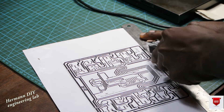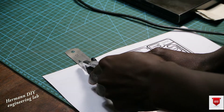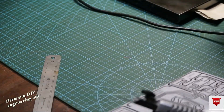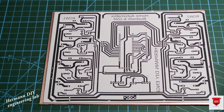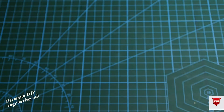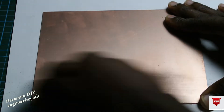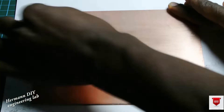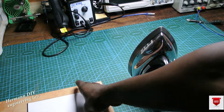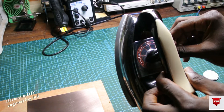To make the board, I cut the copper clad to the size of the printing paper and then I make sure that the copper clad fits the board size. At this point I clean the copper clad using steel wool. Other people use acetone, but I prefer to use steel wool because that's what I have.